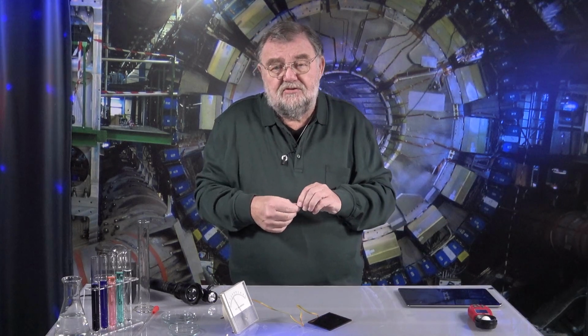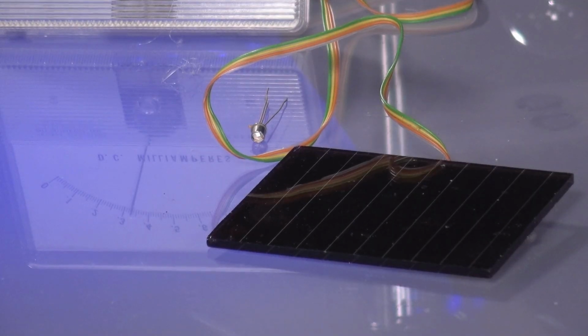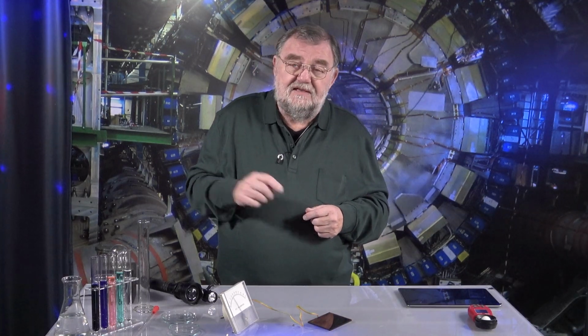The point of it is not to get energy out of the sunlight or any other light source, but to bring the signal from the light into our electric current area, so we can measure it and display it either with an ammeter or naturally with a measuring amplifier or digitally, and that is then calibrated. And when it is calibrated, I can tell you exactly this amount of light, so many lux I have here, on this or this or this or here in front of my face. Now we want to think, what can I do with this when I can determine the quantity of light on a certain spot?